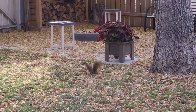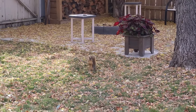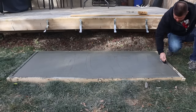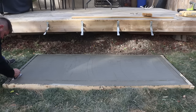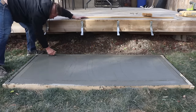While I was waiting for the concrete to set up further, I had a little visitor come and join me — I was amazed, Slade let him be and didn't chase him off. So anyway, we're at about the three hour mark now since we poured the slab. Now that the slab has firmed up quite a bit more, we're going to come back and repeat the same steps, but because it is firmer this is going to be more of a refinement step and you're going to notice it comes out a lot smoother.